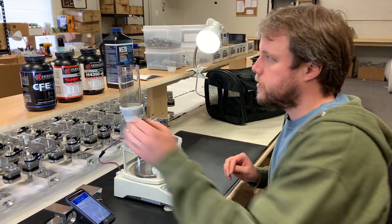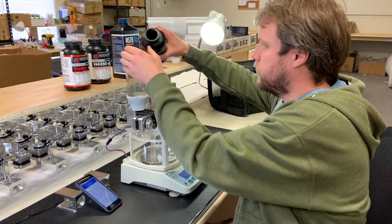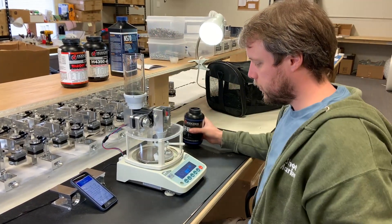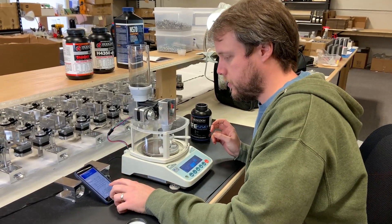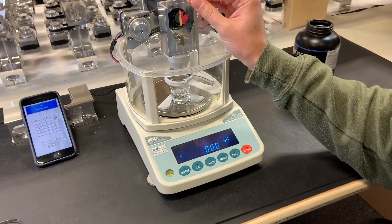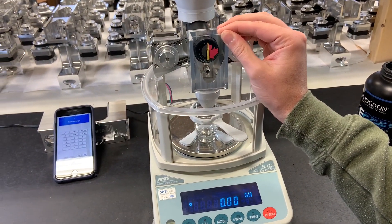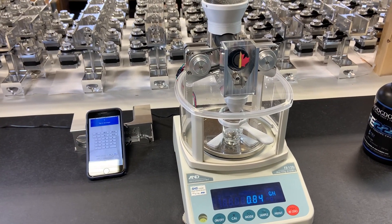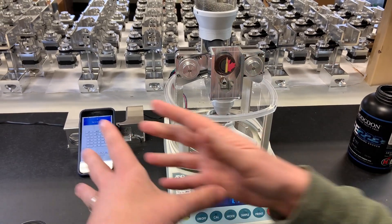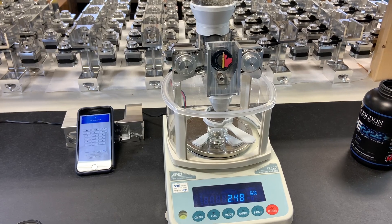Starting with the CFE223, I have everything leveled and ready to go. The first thing I'm going to do is hit slow — that's just going to run the small tube at full speed — and then I can tilt it down just a little bit to get it going. As soon as I see powder, I'm going to stop. That just gets the tube primed, but when you tilt it down like that, there's a lot of powder coming through at once, so you need to give it a few seconds to stabilize before you calibrate.